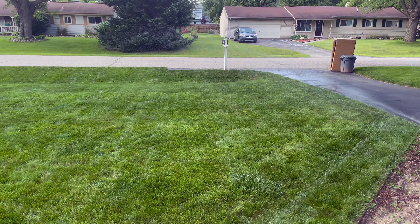This first one here has just about a tenth of an inch of water. The second one — right around a tenth of an inch of water. The last one, the one that was on the hill — also about a tenth of an inch. So now we know this sprinkler puts out about a tenth of an inch in 15 minutes. That means if this sprinkler were the only one covering this area, we would need five times our run time to get half an inch.